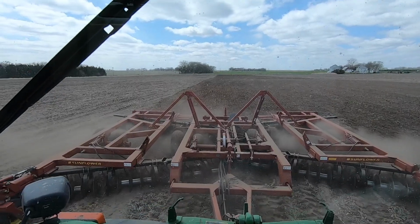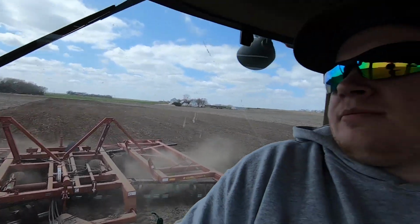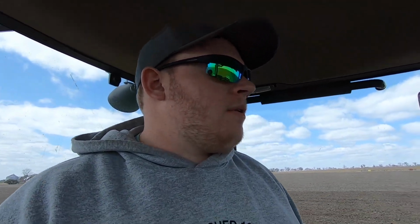What really would help is if on the back of the disc, rather than the metal tine harrow, we had a crumbler, which is just a bunch of rods welded into kind of a basket in a cylinder shape, and it spins along, breaking up the clumps and clods. There's a spot down here too that's pretty clumpy as well, that would help out.